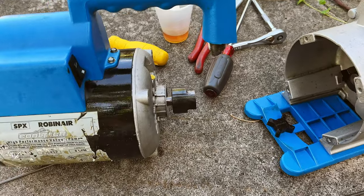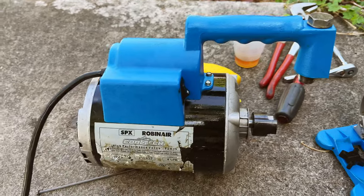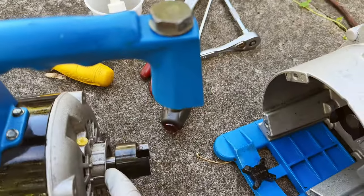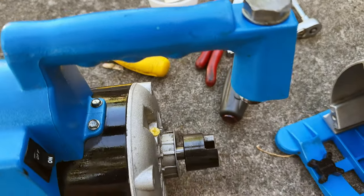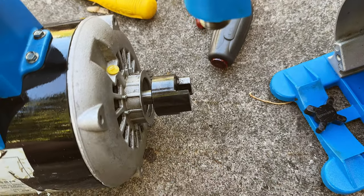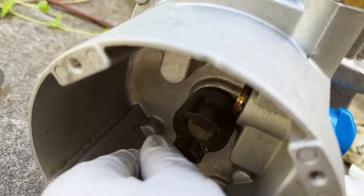I think this is a great pump for $150 if you can find it on sale. A little bit of elbow grease is able to help you keep this pump running for a long time. First thing — you need to add some oil to the front and back oil ports for the bearings. I think there are two bearings. You don't need a lot — maximum one tablespoon of oil is all you need. If you keep adding oil to the front one, it's going to seep through and leak out, so you don't need a lot.